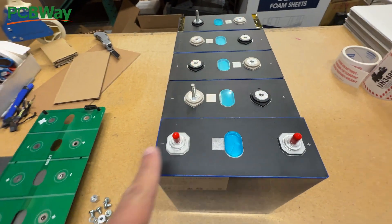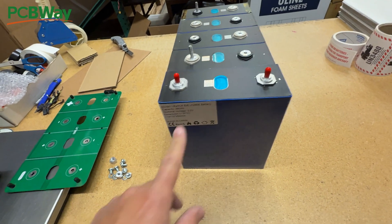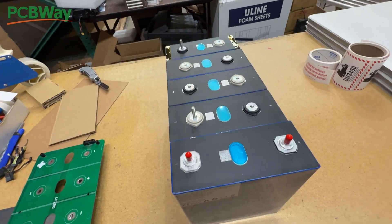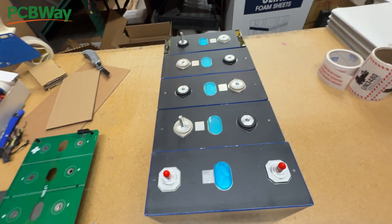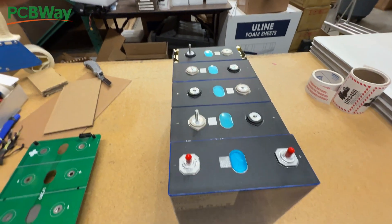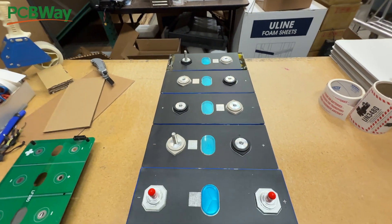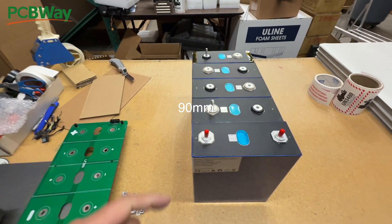Take a look at these two cells right here. See the difference between the posts? This is a standard that is emerging and most manufacturers are making it now, but some are still making the old one. So if you just happened to have bought some of these a while ago, or maybe you found a good deal and bought them — the problem is that none of our PCB bus bars will work. So that's what we're going to fix today: make a PCB with this dimension, measure this distance, then go to the drawing program and design it.